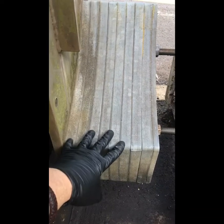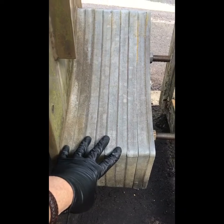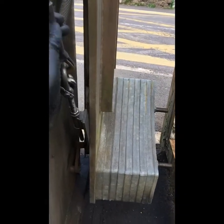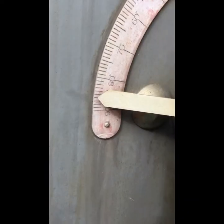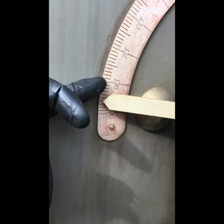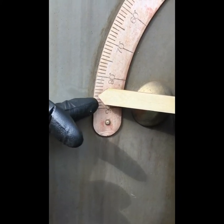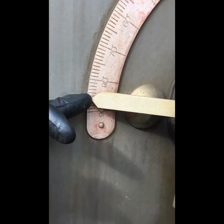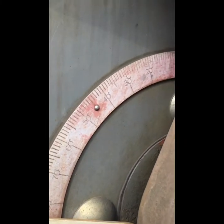These are all the counterbalance weights you add onto the outside there. Obviously if you don't have counterbalance weights, when it goes down it'll whack the floor. You'll also have an adjuster here that you can adjust to go up and down on it as well. This is your inclinometer on the side, so you can set your contacts inside so they all work at the correct angle — anything over 83 degrees and it's in the up position, and you can use that to set it.